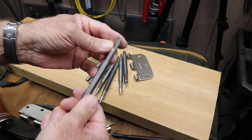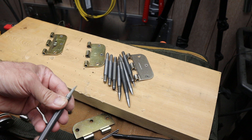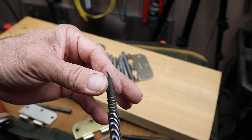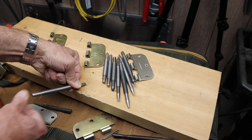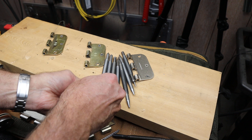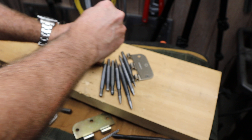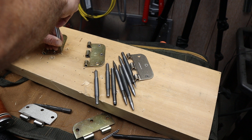This is an interesting one — if you do anything with door hinges, you know you sometimes have to cut just around the corners or dig them a hair deeper. Maybe the door isn't hanging straight, or it's got too much humidity and doesn't fit right. This is a chisel, but instead of hitting it with a hammer, you can very carefully chisel into the wood to dig out what you need. It's also great for scoring an edge — you can mark where you need to go along the edge and then cut through once it's off.